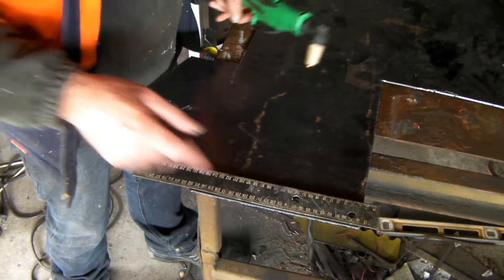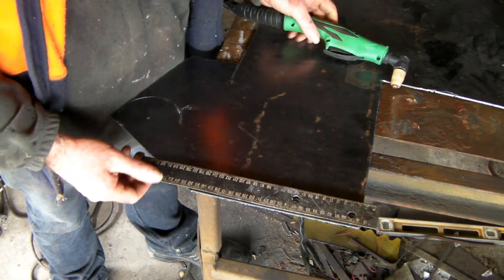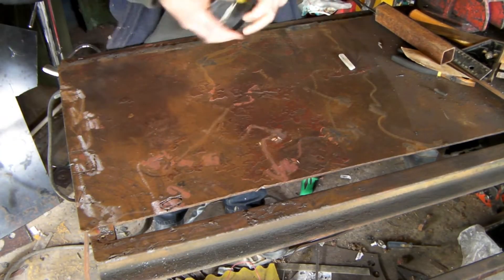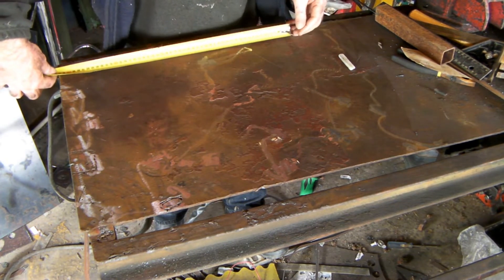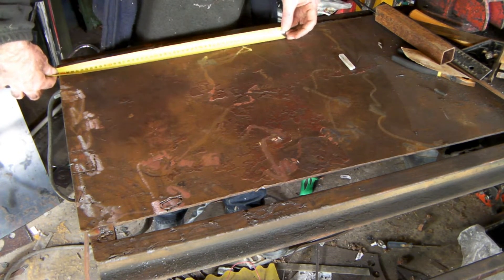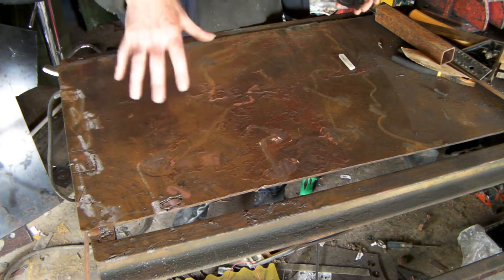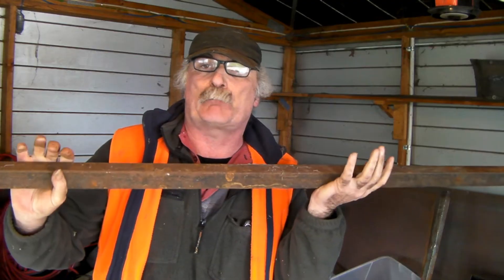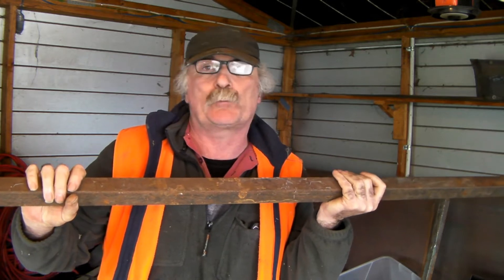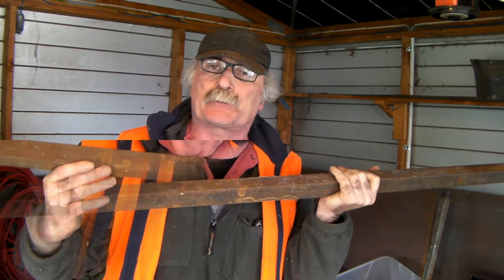Anyway, Pete, stop waffling and let's try and make something, eh? It's sort of like a little frame that we can sit on here. Say about 500 - 500 square would probably do it, from there to there. And if we go across there, 500 square would do it, and that would give me a working area where I could plasma cut on solid ground rather than having to drag it off the top of the table. So what I came up with was a length of old box section that I had out the back of the garage - I think it's about 2.4 metres long. So if we whack four parts into 500, we should be right, so I can make a little square and that'll be the frame for my table. And where do you think I got this from, guys? You guessed it - the dump.